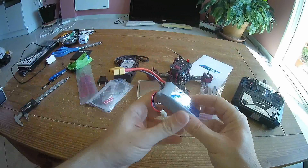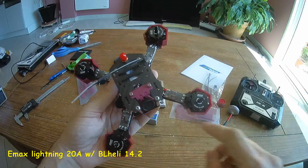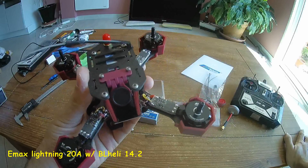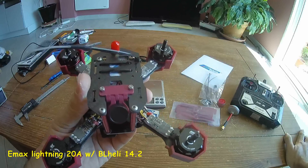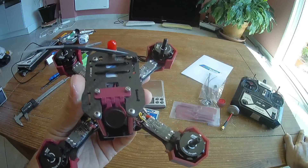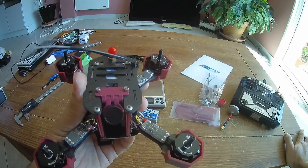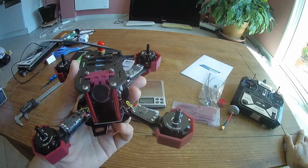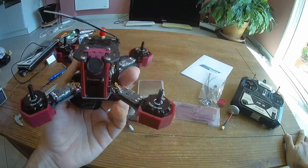It's a great strong battery. The good news is you can power this machine either with 3S or 4S. The ESCs support up to 20 amps — that's cool. They are flashed with a relatively recent version of BLHeli. Be aware: if you want to flash a new version of the BLHeli firmware, please don't use the one indicated by BLHeli Suite when you connect through CleanFlight pass-through, because it will most probably break your ESC. You can recover them, but it's a little bit tricky.